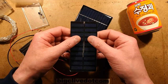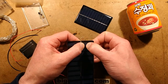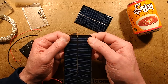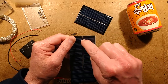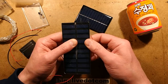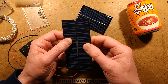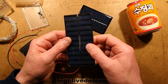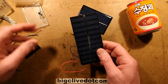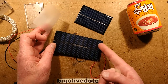If you watch the solar panel here — if I flex it very slightly — you can hear slight cracking. If I flex it right here in the middle, let's see if this actually shows. It usually shows but it's not showing. So the silicon is fracturing but it's not showing at all. There is a slight hint of white there. I can see the cracks, actually — little white craze lines — but they might not be so visible to you. Even though these panels are cracked and broken, it only takes one or two to actually ruin the whole cell. That is the weakness. That's why it was crap, unfortunately. It's a shame because it's got a decent amount of silicon cells in it, and they're just very brittle.